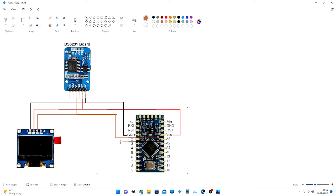Now the second pin is the serial data, which is the closest pin to the reset on the board. And serial data is both connected to the OLED screen and the RTC, the real-time clock, and it's accessed through the management of addresses. So I think you can have 255 different devices all connected to the 2 lines and addressed. You'll find the address of the OLED screen on the back of the OLED screen, and you'll need that for the hard coding in the Arduino code, right?